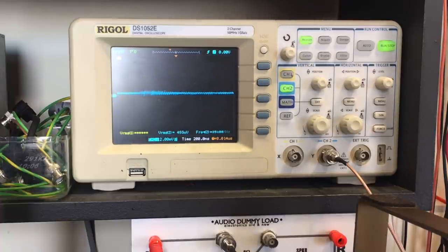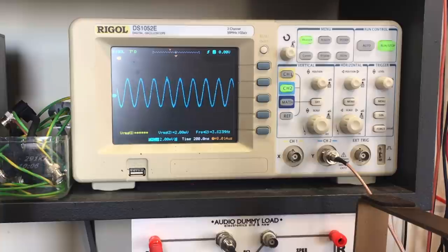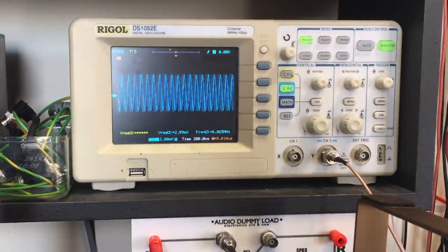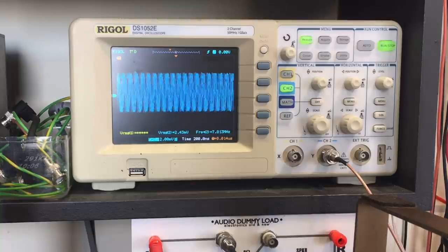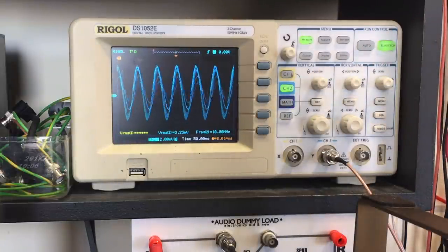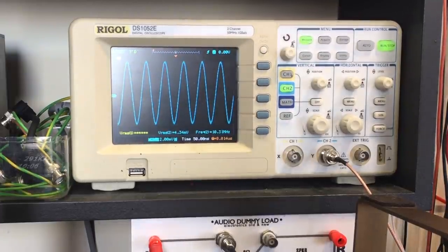If I go up further — there's no antenna, I just want to see the oscillator — if I go up any further it just stops. That's about halfway across the dial, that's where the reception just dies. That's happening on medium wave. If I put it on shortwave, it's giving me 3.7 MHz — that's shortwave 1, 1.58 to 5.2 MHz. If I go up further I still get it, that's 9.6 MHz. But if I go beyond a certain point the oscillator starts dying — there, it's just dead. That means the oscillator capacitor is shorting. I cannot — holy hell, that's 10 MHz — it's going down and going up. This capacitor is kaput.